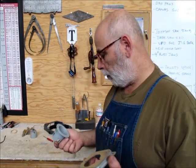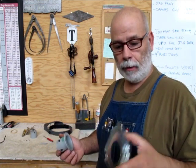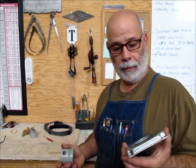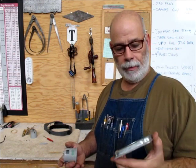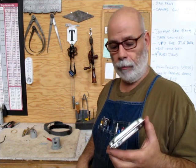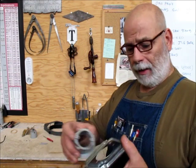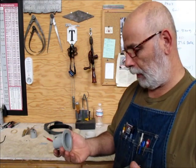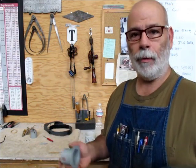I had to do one of these before, but I figured this makes a quick little video you guys would probably like. We're going to use the little mini pallet, the strap clamps, and the boring head to open that up. I could go in there with a die grinder and grind that out, but it's about 200 thousandths or so — enough where I'm just going to use the boring head. It's just easier.